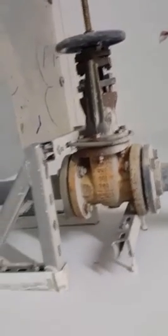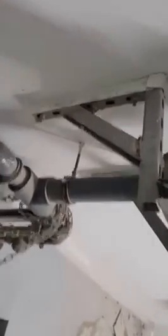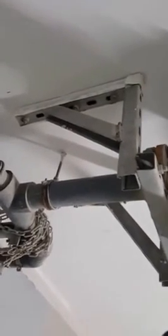This is the rigid support of the tube valve — see how they support the pipe with a U-bolt. The PVC pipe is also supported with couplings and gaskets. You can see the threaded rod on the side — the threaded rod provides support, and as per the pipe specification and size, we use the corresponding threaded rod size. This also goes to an elbow, and we always do the PVC pipe with gaskets.